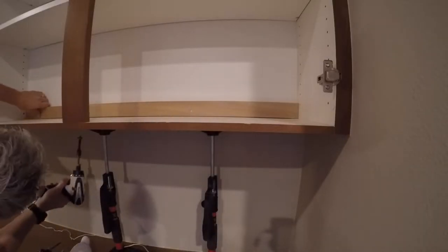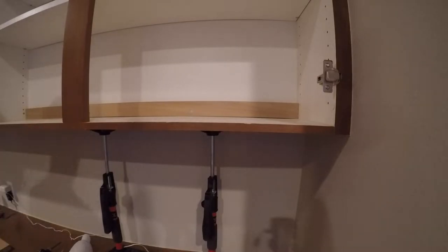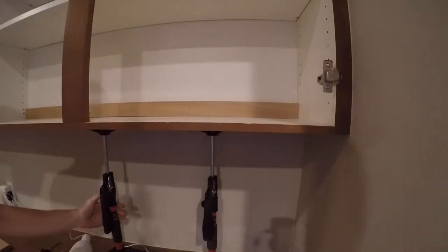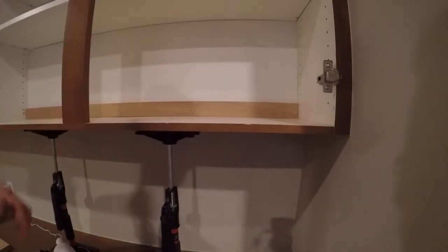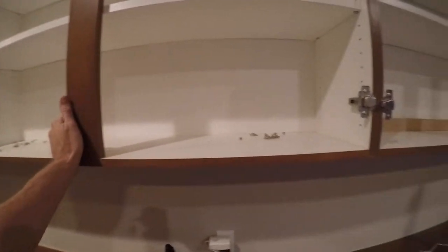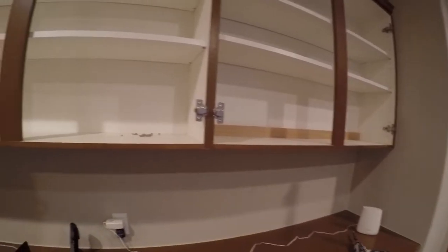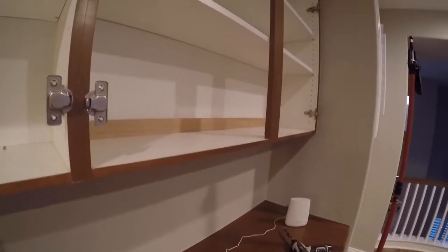Since I confirmed those were actually studs, I feel really confident. I'm going to pre-drill into the wood strip, and as you see me drive these inch-and-five-eighths screws, you can see it close in the space — it's doing what it's supposed to do. I got to move that clamp and put a screw underneath, but as I remove this you can see the cabinet stayed flat. That's a great fix. When the painters come they're going to fill all these holes. I noticed the line from the recent house painting is very visible now because the cabinet is jacked up — I'll have to fix that after everything's done. But this is much better than it was.